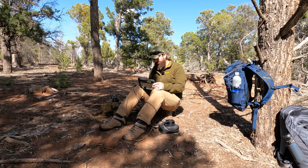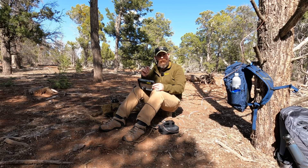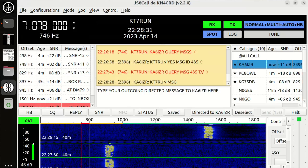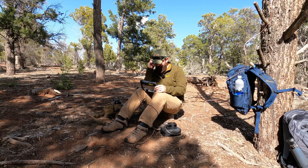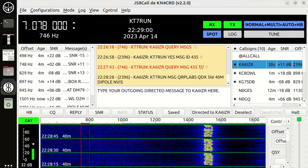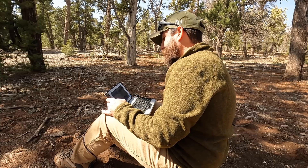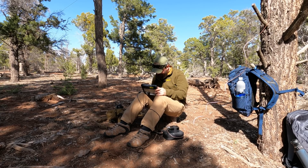Based on the last exercise, this call sign is probably going to jump to the top and include a little flag symbol — right now we just have a little star, which means that station can hear me. A good example: there's no star next to November Zero Golf Echo Sierra, which means I can hear him but he can't hear me. Waiting for the message to populate in the inbox... There's our message from Mike. It says: KT7RUN, message — QRP Labs QDX, 5 watts, 40-meter dipole. Excellent — that was exactly what we had in our comms plan: our radio, our power, and our antenna. Mike is actually running a twin setup — I sent him my second QDX and he's the second person to have the link dipole, so we're both running on 5 watts.